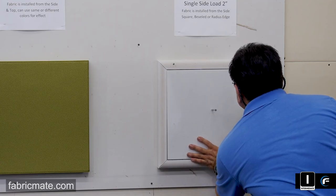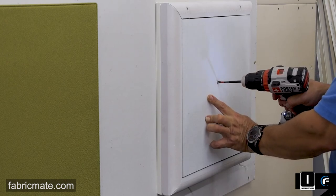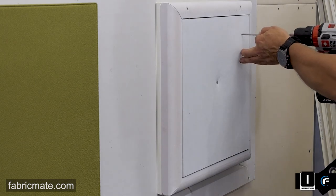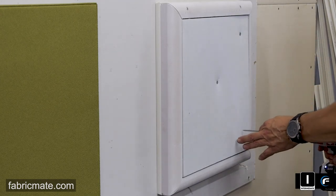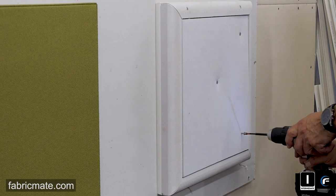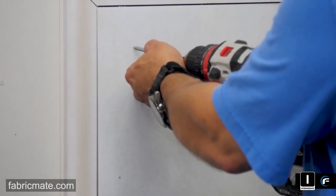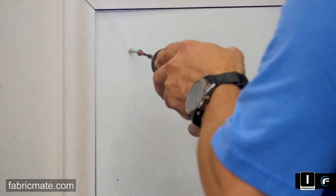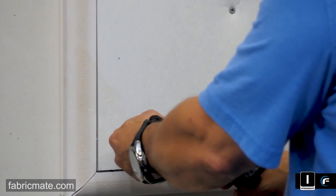Using the 3 inch screw once again. The ReCore is recycled from plastic bottles — environmentally friendly. No itching, not like yellow glass out there and other products that are going to have maybe airborne fibers or be itchy to the touch. Real popular in the home environment, education environment, anywhere where they're trying to get away from some of the products that have been used over the years, like regular insulation and yellow glass. A real nice product to work with.